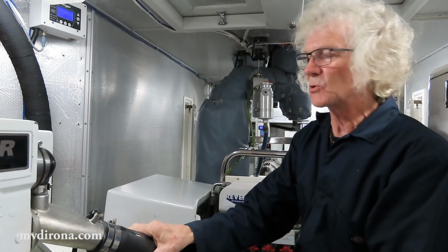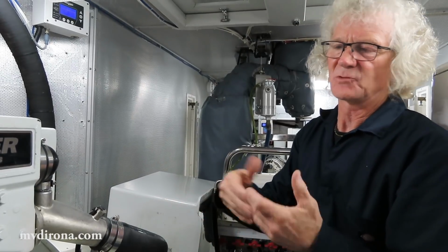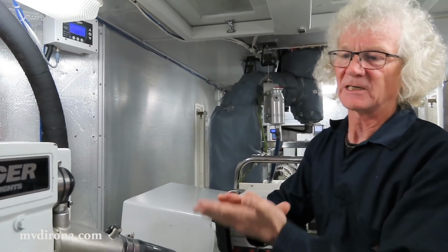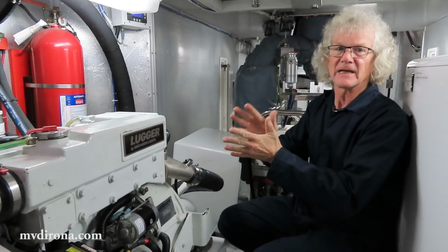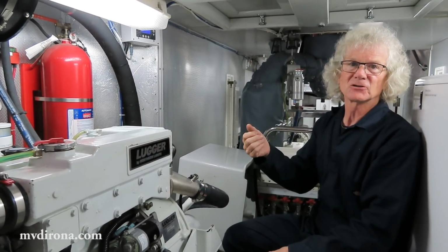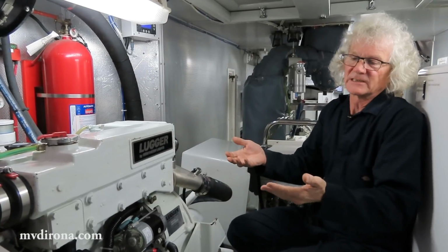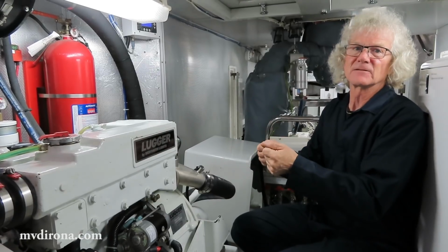Okay, to demonstrate this problem, I'm going to start up the engine, and when it's started, the clutch will initially be disengaged. So we'll start the engine, you'll hear it idling, and it'll be making some noise, because when the clutch is disengaged, the bearing is rotating and grinding away because the bearing is worn out. Then I'll turn the hydraulic system on. When I do, you'll hear the noise go away, and the difference is normal diesel engine noise versus the noise with that bad bearing. You can quite distinctly hear the difference between them.